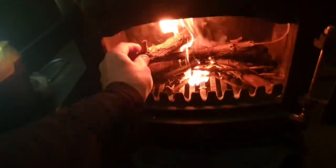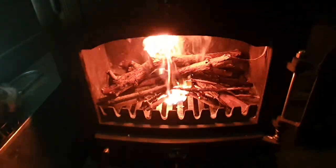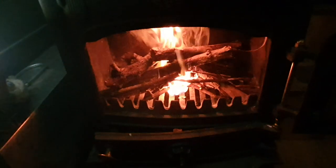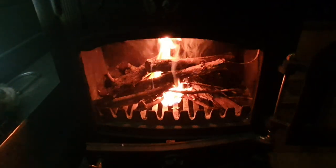So I've got that little size there — put that on top, and another one. And there we go, there's my fire. All I have to do then is open the ash drawer to let some air come in from the bottom. Wood burns however air can come — from the bottom or from the side. Coal requires air coming in from below the grate. So I'll just close the door now and let that take.